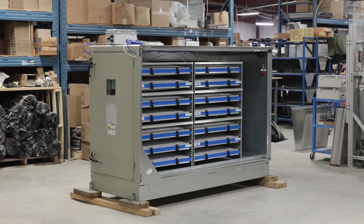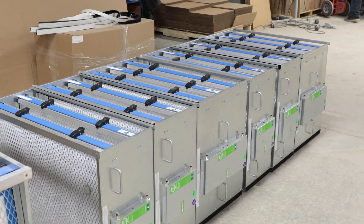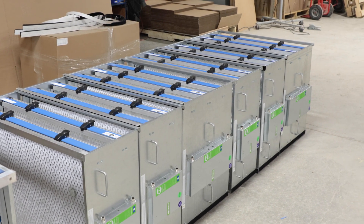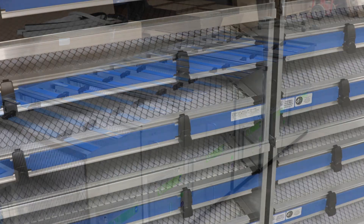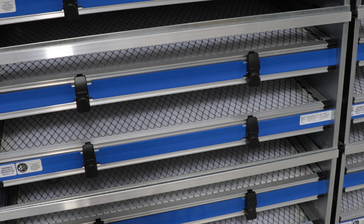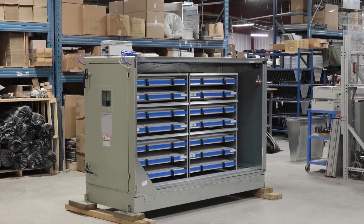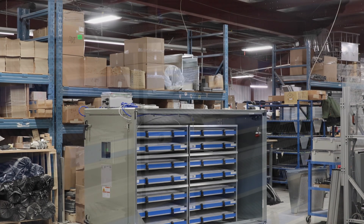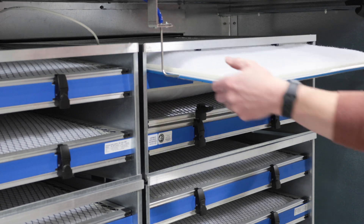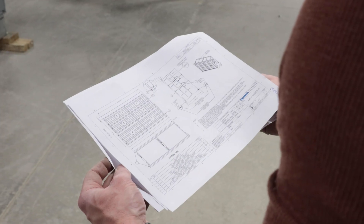The Dynamic V8 SL is a modular system with a stacking, self-supporting racking system that allows them to be installed and accessed from the side of an air handler for applications with no in-unit service access. Pre-filters are generally not needed but may be recommended based on the application. Module width is chosen to minimize the overall number of modules and keep the same width in each air handling unit. This simplifies media replacement and ordering. Each module is numbered and is installed according to the submittal drawing.